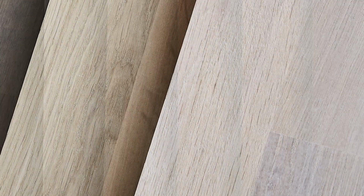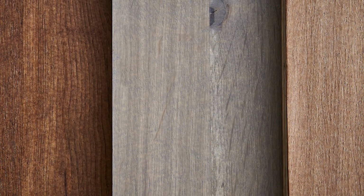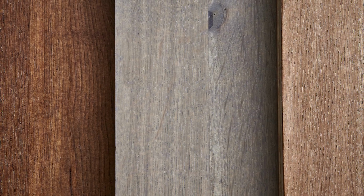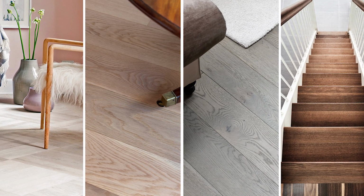In the UK and Ireland, professional floor finishers come up against lots of pine floors instead of oak like in Scandinavia or the US. Pine is quite tricky to colour as oils lose their intensity and stains can be quite messy and show up inconsistencies. By adding colour to the primer, the wood species isn't so important.